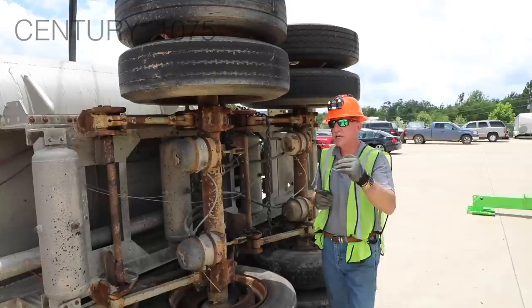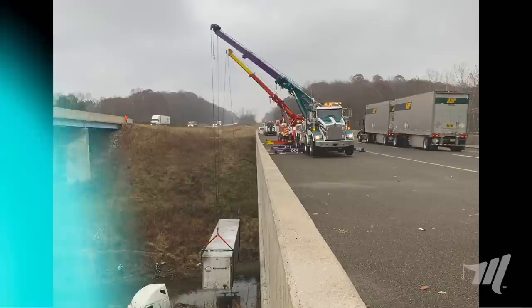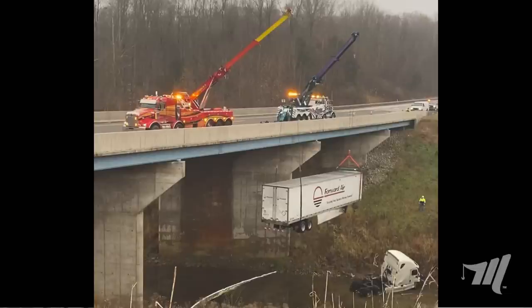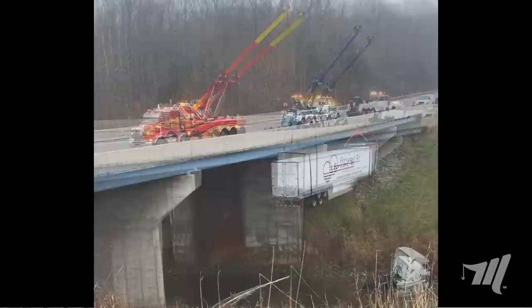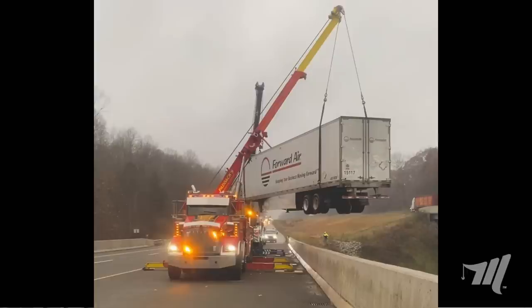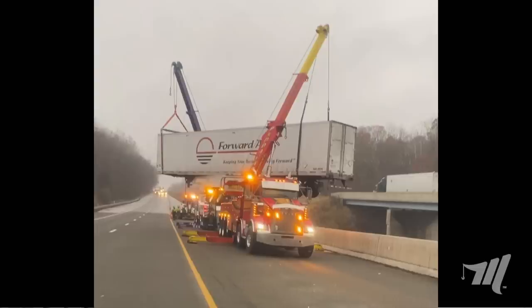Remember, this is a lift where we get out of our norm. This is down in a ravine — 20, 30, 40, 60, whatever feet — we're lifting this vehicle up. It's going to be a lot higher than just clearing the outrigger sitting on the interstate, so stability is the critical thing. Always think: if this is a bus, where's the engine? What's going to be the first part of the weight we want to move through, so we're moving less weight between the two units and therefore adding stability.